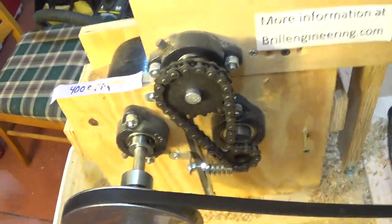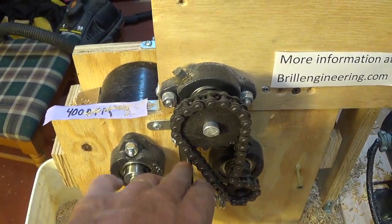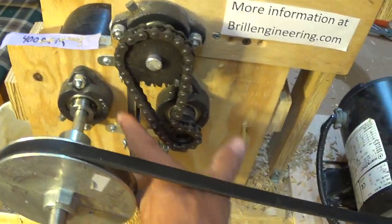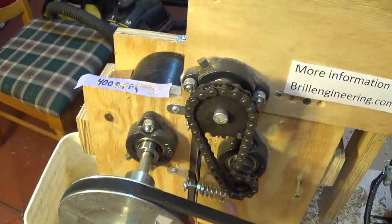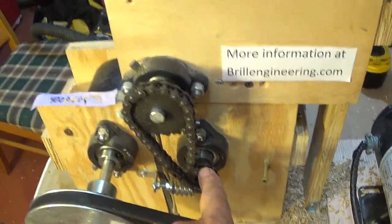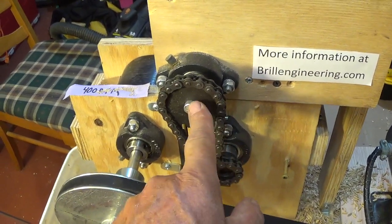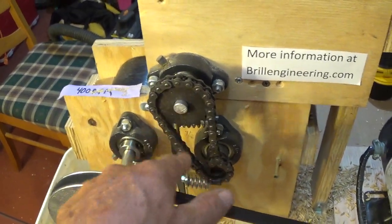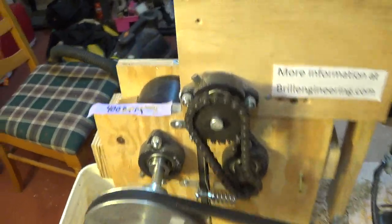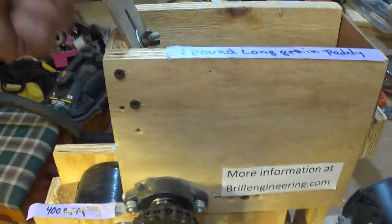It's another opportunity for people to make their own. All the dimensions would stay the same. What you would do is change the space between the hole and the edge so you could have a gap in there. The other thing I've changed: instead of having a 10 or 11 tooth sprocket on both sides, I left this one at 10 and made this one around 18. So it slows this roller down a lot, and that way I can open up the gap.